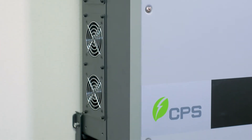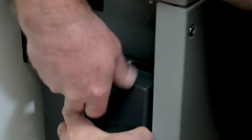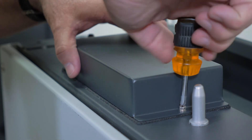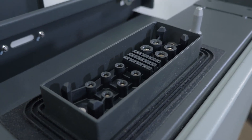Wire nuts must be applied to the ends of each of the conductors and all secured in the large junction box you were just required to install. When this occurs using a CPS inverter with the separable wire box, these steps are unnecessary. The CPS wire box safely contains all the conductors, so no extra components or additional steps are required. Simply screw the connector cover back over the wire box connector. All CPS string inverters include this feature, from the new 100, 125 kilowatt, 1500 volt inverter to the inverters you installed years ago.